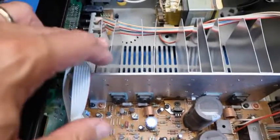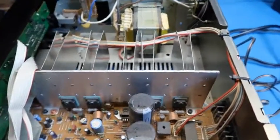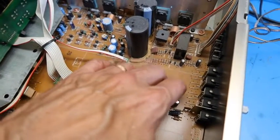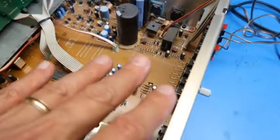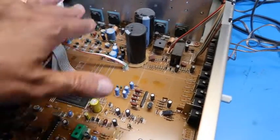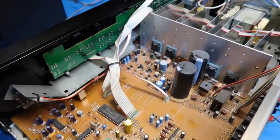You can see that we've got essentially two little heat fins for each power transistor. There's something else maybe attached to this heat sink. This type of one-sided PC board has PC board traces on the other side, and then we've got these wire jumpers that sort of form, in effect, a top layer. For this type of audio circuit you typically don't need a very complicated PC board. Using these jumpers is what they seem to find to be the best economics. For a mass-marketed unit like this, every little penny counts.